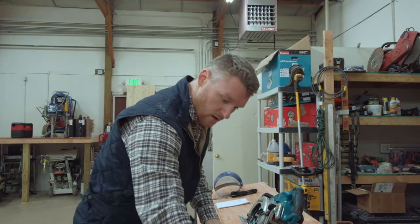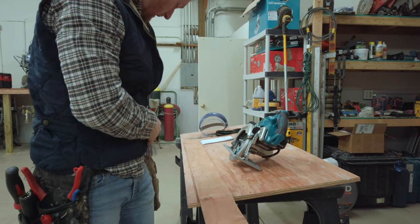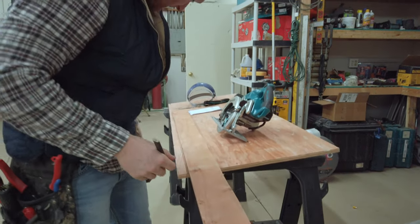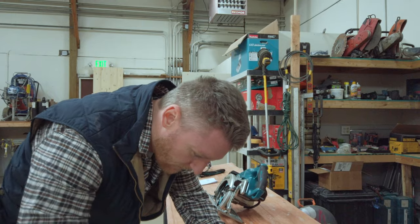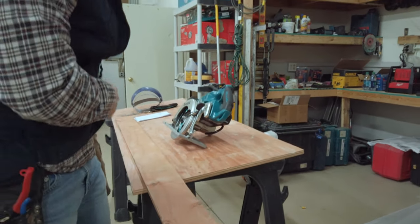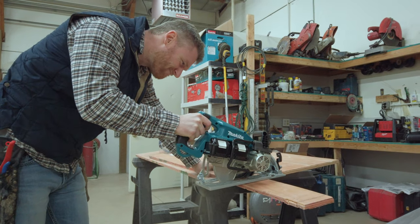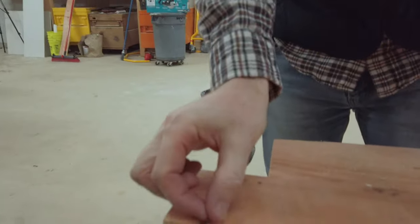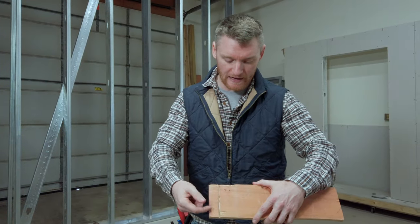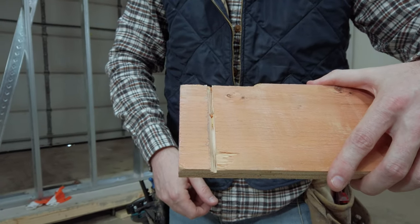It's 16 inches — I'm going to go ahead and mark that out. Then I'll rabbet over on this side at about an inch and an eighth to about an inch and a quarter, so I'll do a couple cuts to notch this out. This whole spot in there has to be gone so that I can fit my flange in there. As you guys can see, this will be enough for the flange. I'll have a little bit of wiggle room so I can place it where I need to. We marked it at about an inch and an eighth and an inch and a quarter, cut that rabbet down, and went in about three-eighths of an inch to fit that flange inside.